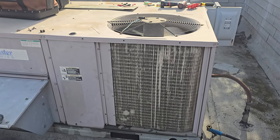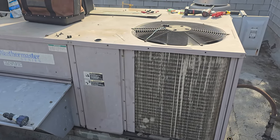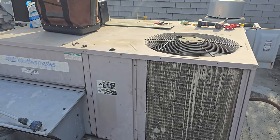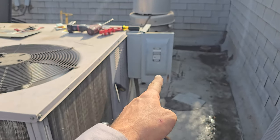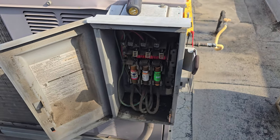We're going to wrap this one up and they're going to have to consider replacing this unit. We could put a new condenser — if we do that, we would probably put a new evaporator too, because you'd get new fixed orifice metering devices. But I don't know if they want to put that much money into this unit. So that's it for this one. Sometimes it's just a little cleaning and love. Last but not least, we've got to get this disconnect changed too because it's not making a good connection, but I think we're going to be okay for now.